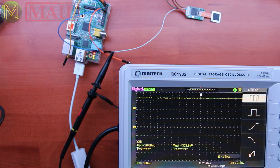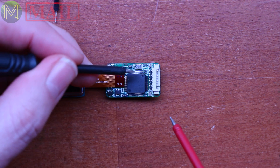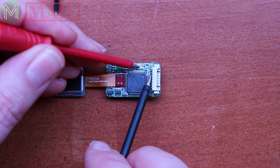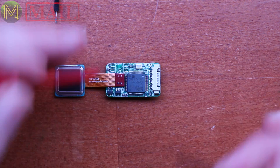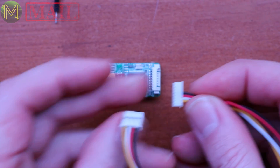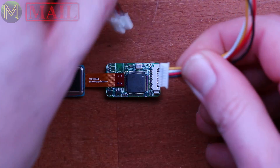I've connected up the RX pin and I'm pressing carriage return on the keyboard, and I'm certainly getting an RX signal out. So the first things you need to find out when you're buzzing out a circuit board is ground. Because we've got a nice juicy crystal oscillator, the case is usually ground, and then we can buzz out the rest of them. So pin four — going down from here, it's pin four. Now if we look at the so-called Grove connector, it actually connects this way. The ground is on pin four but they've put it around the other way.